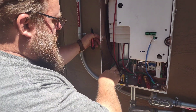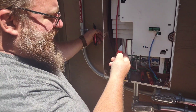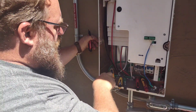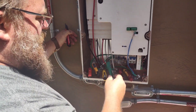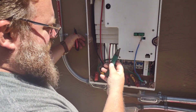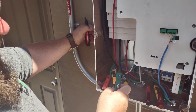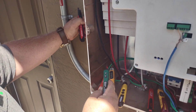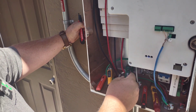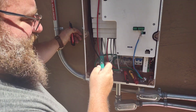This one — you have to hold it on — works okay. You can get these at Harbor Freight in a pinch, they work, but I want to be able to see it's on all the time. This one here is a Commercial Electric — nothing wrong with the company, but they're a cheaper brand, and I paid the same as all the others. This one has a very poor green light — I can't tell it's on. But when I stick it near anything, it goes off everywhere. I can't tell which wire is hot because it's triggering on everything nearby. It's too sensitive and not precise enough.